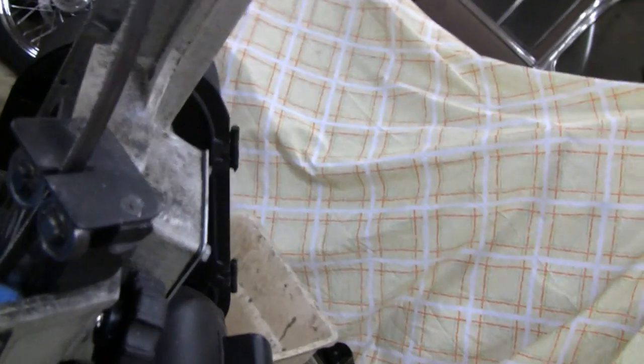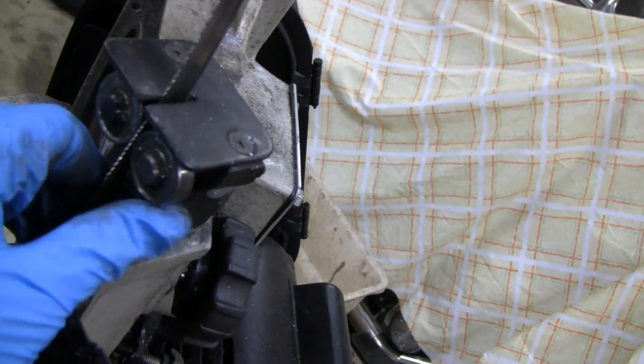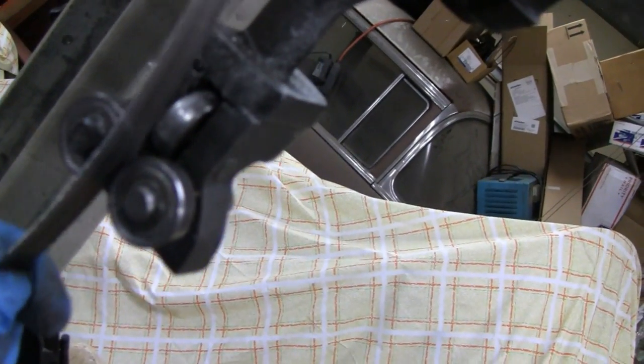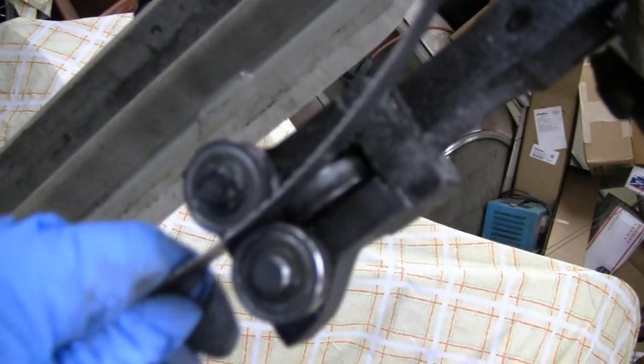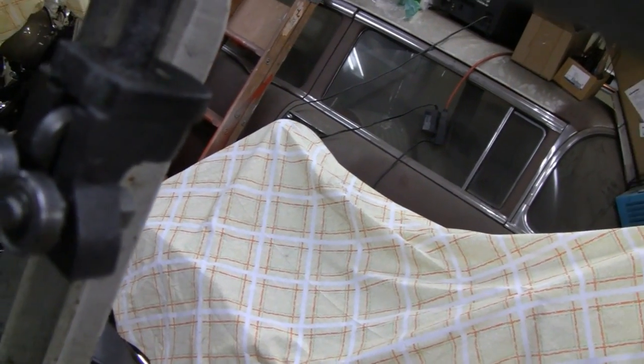Here's what I wanted to show you. Down here, when you put the blade in, you see the way it goes in between them? When that blade is in there, you should be able to spin these wheels with your finger — just barely. These top ones were so tight I can't even get the blade in there. Look, it goes in a little bit, but on certain parts of the saw it won't even go in. So that's not good.